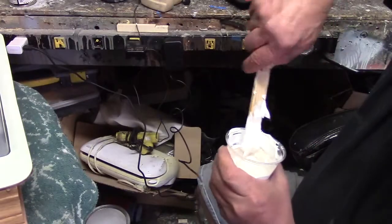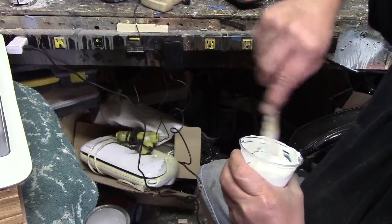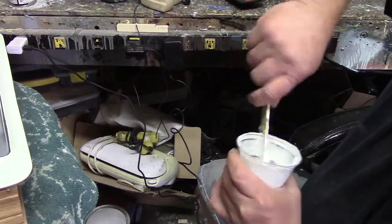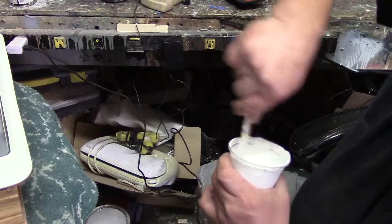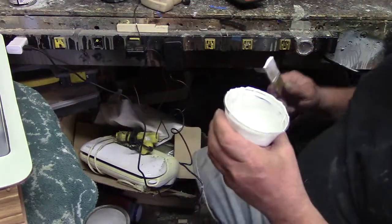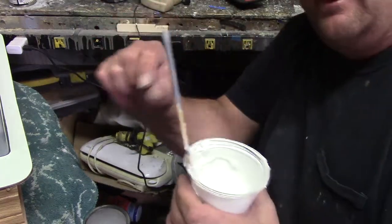Now I'm going to mix this stuff. Associated sells a white resin for mold making and it's quite a bit cheaper than regular resin, but I don't like to have two different types. I can hardly afford to keep stocked up in regular resin, much less two different kinds. Now this stuff is quite a bit thinner than that black aluminum-filled resin. This is cheaper but it doesn't have the crush strength — that's the difference between this white surface coat and regular white resin.